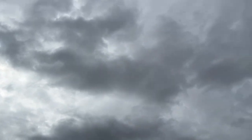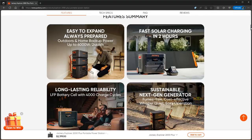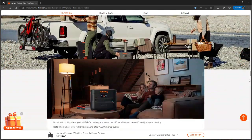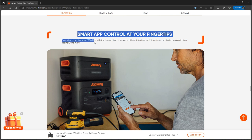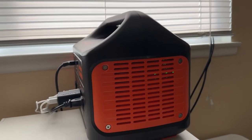So I think having a 2 kilowatt battery, which is double my current battery size, would have helped a lot in covering these gaps. And having the battery have some sort of app feature would have saved me a lot of trouble as well, since without a way to wirelessly monitor the battery's status, I had to check on it pretty much every day. Other than that, the system worked exactly how I thought it would.